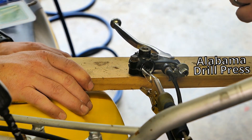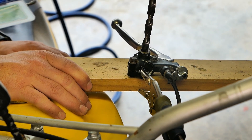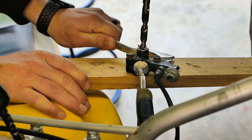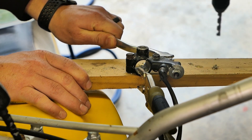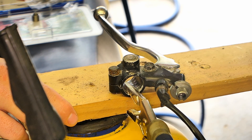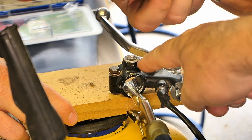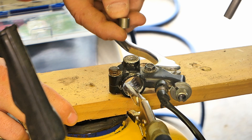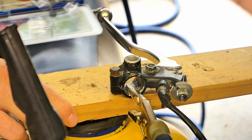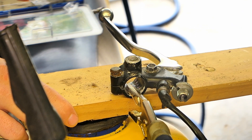So we're drilling it, then we're going to tap it, and then we screw in the helicoil — that's pretty much the basis. Do we oil it first? No, we don't need oil, it's just aluminum. All right, so we have drilled the hole and now we're going to make threads — not to put a bolt in, but to put that coil in. We're going to be screwing it down in there and then your threads are repaired. First though we've got to make threads, so there's just a nice clean tube that we're going to cut threads into — re-tapping bigger threads that the helicoil fits.